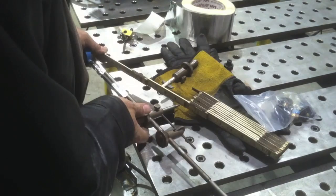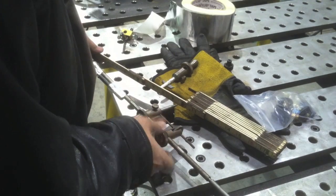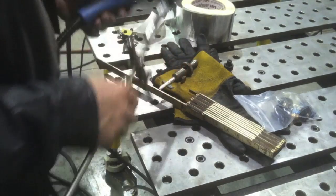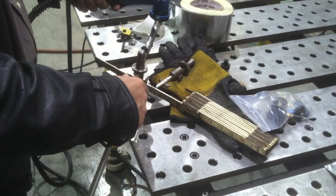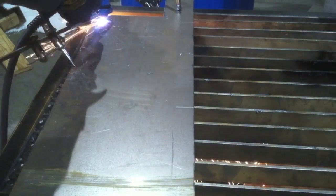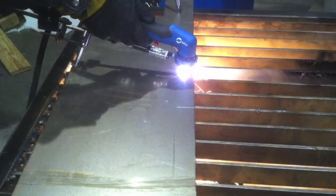So what I'm doing is just taping it onto a set of trammel points — I'm only going to make two cuts with it, so it's not worth going to a whole lot of effort for something more substantial. I've got quite a bit of tolerance on the outside of that radius. If I make it a little bigger by an eighth it'll just give me a little more clearance, and I'm making it plenty big — not a tight fit.